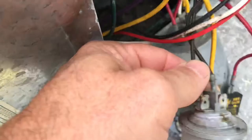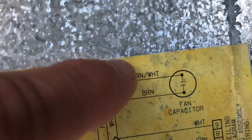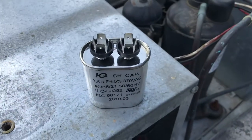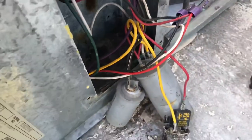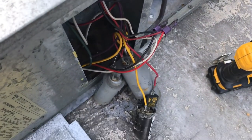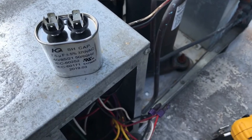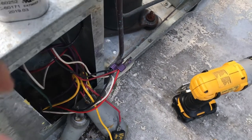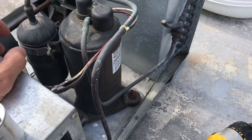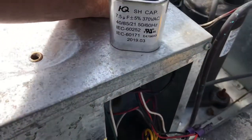I'm back on top of the camper. My new part arrived, so we're going to install it. The capacitor is brown and white — we were looking at the label which said fan motor, brown and white and brown wires. We're going to disconnect those, put this new one in, and stuff everything back in and give it a try. I just want to point out: first, make sure your camper will support you standing on top of it — mine will, but not every one of them. You'd obviously never do this on a pop-up camper. Be careful because you're up high — I'm eight feet off the ground, so stepping off would not be good.